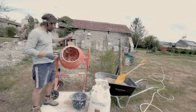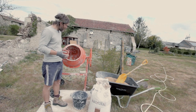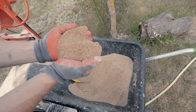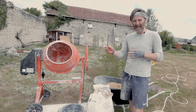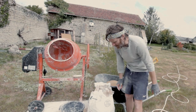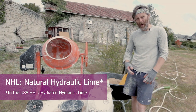What do you need? It's going to be much easier with a cement mixer, although you can easily do small amounts in a big bucket or a tub. You're going to need sand — this sand here is a mixture of fine sand. When you have a good mixture it will bond much better. If you've just got fine sand or big stony sand then it's just going to crumble a lot more, so you want a good mixture that's going to set well with the lime.